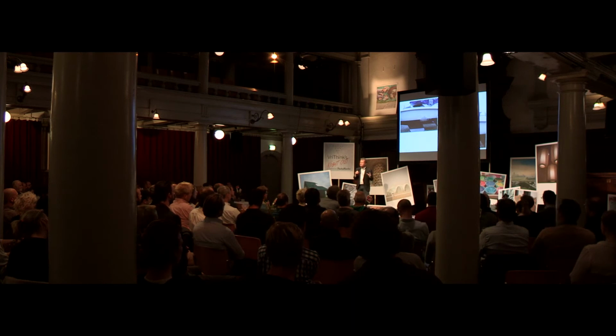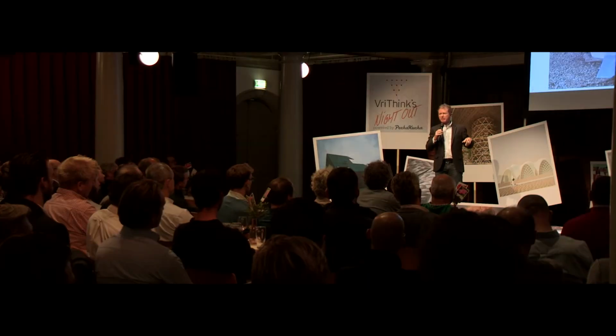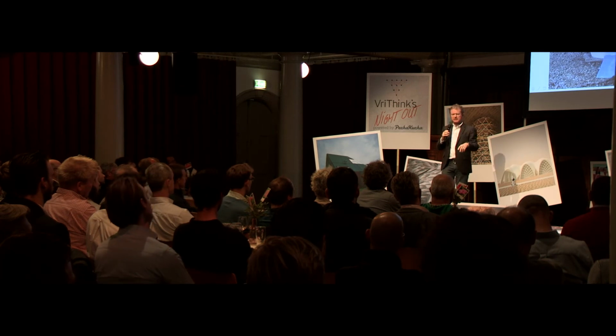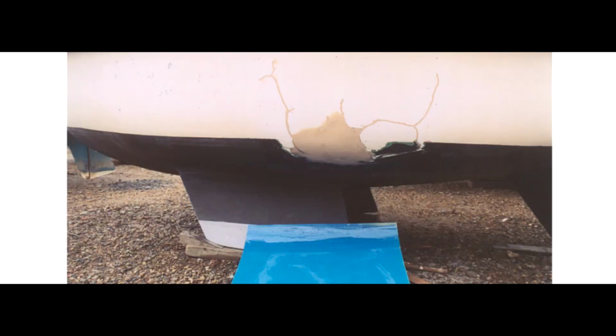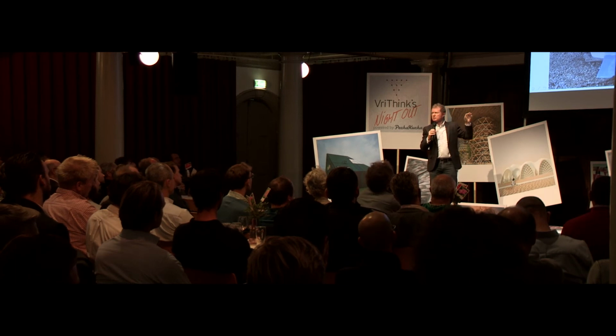And so I went through a process of working inside the boat, because I did the repair in winter time. So working inside, I had a boat-shaped workshop. I just faired the damage with some filler, and then I made it very good, polished it up with wet and dry paper, and got a really good gloss on it. And then I took a splash off the area by waxing it and making a mould, and then releasing that mould away. And maybe you can see just along the perimeter of this repair, there are little holes which I drilled through the whole lot so I could secure the splash.